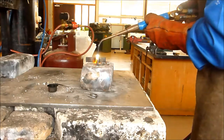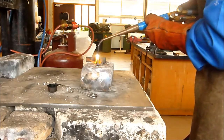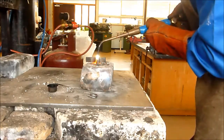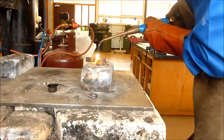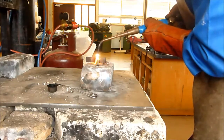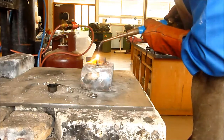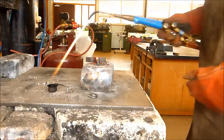The other important thing is to get a nice distance away from the work. You don't want the blue cone touching the work — it needs to sit about a cone's distance or a little more away. Sit at that angle and just wait, heat it up. Once the sparks start popping around, that means it is molten. Give the torch a bit of a wiggle and the metal joins together. That's called a tack.